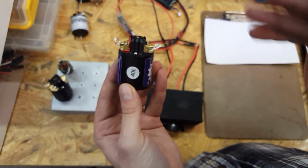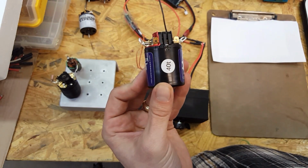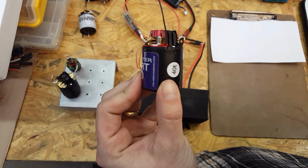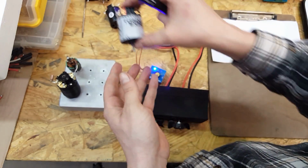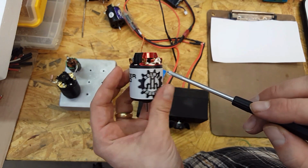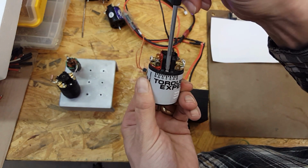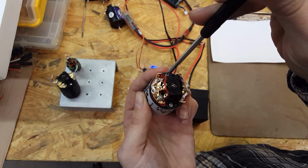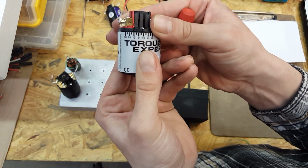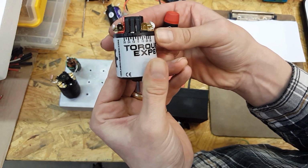Now, on this one, I should note that we have that little timing mark as indicated, and there is not one on the other side of the can. Our newer sticker design, you can't see those marks anymore, but we have marked for you on the sticker. So you would just use the little center hash mark, same way. For forwards rotation, you would go to, let's say, 12 degrees. And for reverse rotation, you would go in this direction for, let's say, 12 degrees.